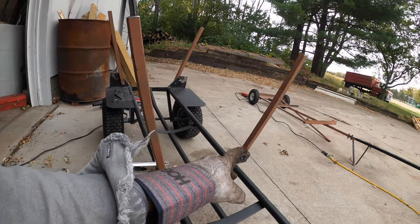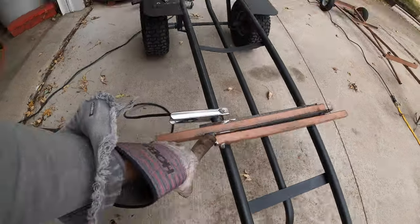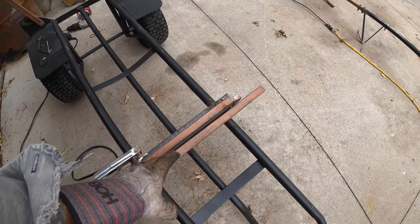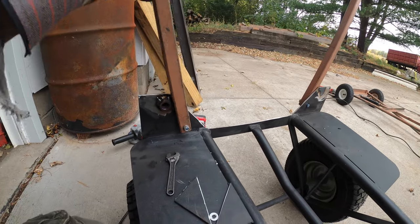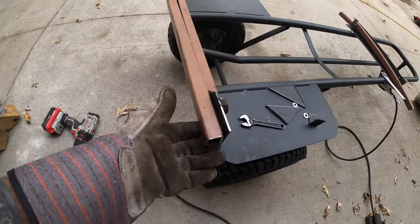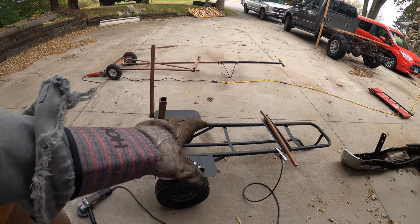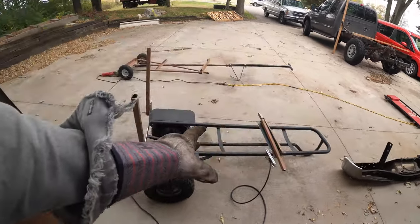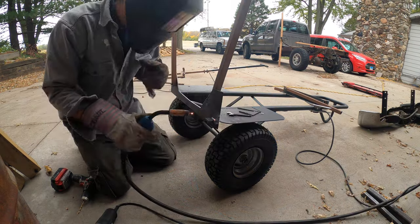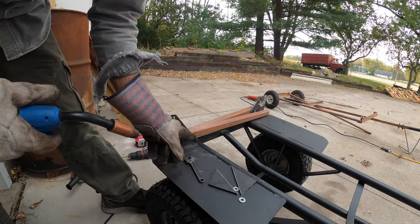Just to check in — I've got the four fold-down arms in place. These front ones rest on these tabs here and they kind of tension over the bolts so they don't flop around too much, but I'll probably put either a tie or a catch or latch on these guys just so they don't fold up. These guys back here rest on the nuts on the flat side and fold down like so. I still need to put a catch over here so this one doesn't go too far. Next thing is the extendo arm off the back — I want the weight distributed pretty evenly over the wheel so the wood is half this way and half this way. I'll put a little dab of Loctite on each bolt.